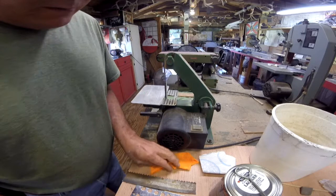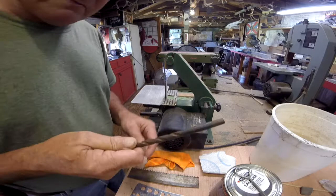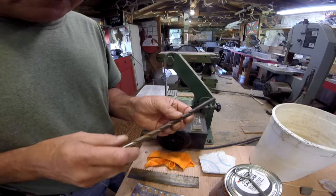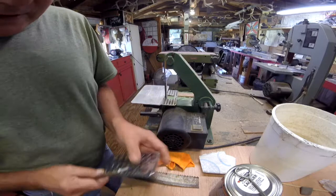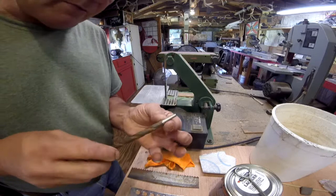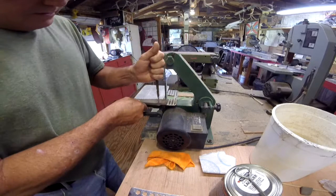So I brainstormed. This is an old drill bit — an old masonry bit, I mean old, old, old. I think when they first came out with the carbide tips. I couldn't grind that off; I had to cut the end of it off. And I'm grinding it down on my little sander here. I've got a gauge, and when I get to the proper diameter I'll put a sharp point on it and heat treat it. And it's long enough where I can work with it.